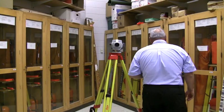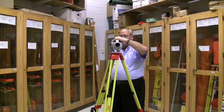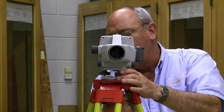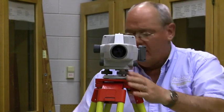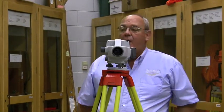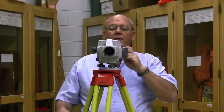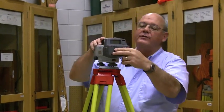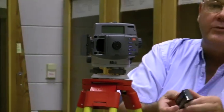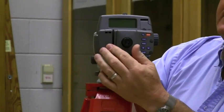The instrument itself is just like the auto level in a sense — it has three leveling screws and mounts on the tripod. The same rules for the tripod hold for all instruments: the feet need to be firmly planted in the ground and the tabletop needs to be as level as possible. The biggest difference with this instrument is it has a battery, which goes in a little door compartment. The battery has two pinholes in one end and no pinholes in the other — the pinhole end goes in first; push it in and close the door.